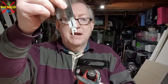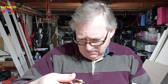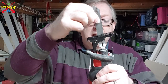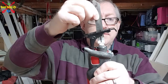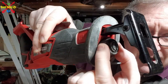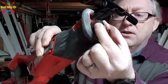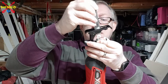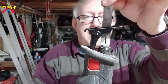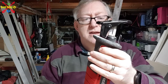I'll show it on the table with everything laid out. To put the blade in — the blades look like this; this is a metal cutting blade. Now, to get it in, you can't just push it in — it won't go in. What you've got is this collar. You twist it, and as you twist it, it will allow the blade in and then lock it into place. So twist the collar, get your blade, push it all the way down — locked into place, and now it won't come out. Pretty good! So that's in, locked in, ready to go.